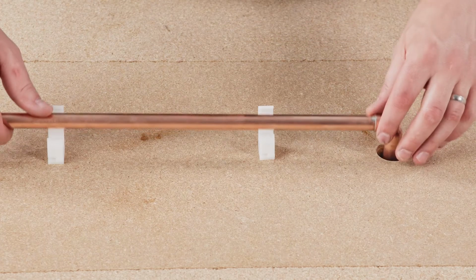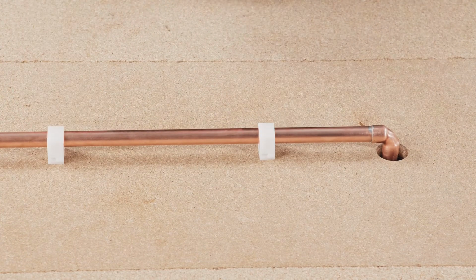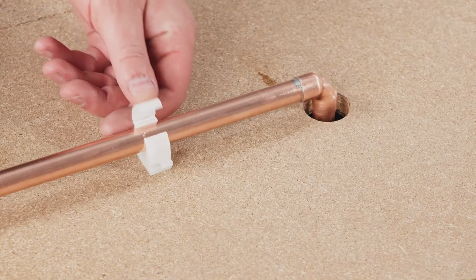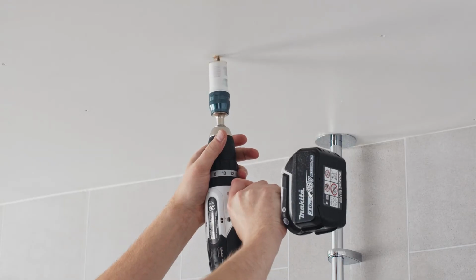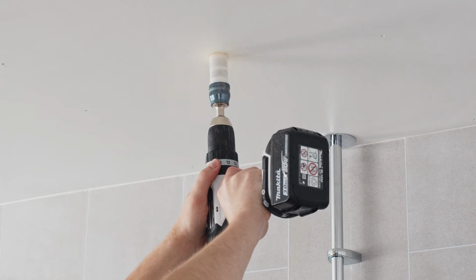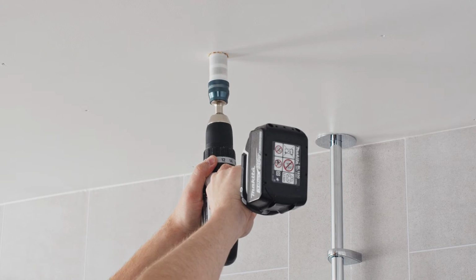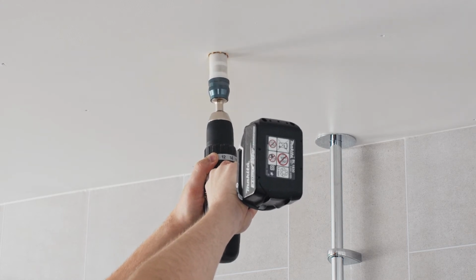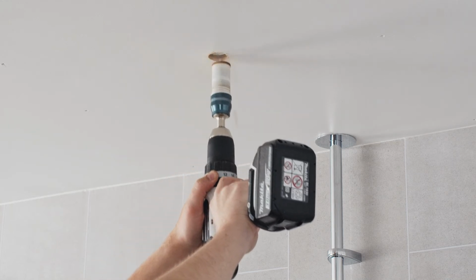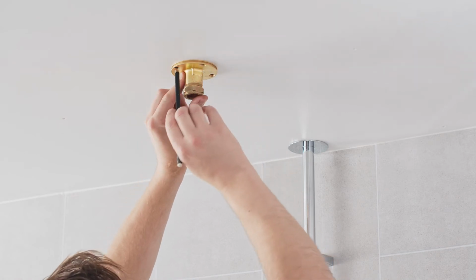For dual outlet installations, the pipework from the valve to the ceiling fed deluge should be a well supported and clipped 15mm supply. This could be secured to a joist or a ply sheet, for instance. The overhead mounting assembly can then be installed with the wall plate being used to mark the ceiling. The ceiling can then be drilled, taking care to avoid the pipework in the ceiling space. The backplate fixing points can then also be marked and drilled.